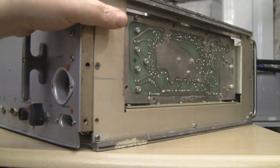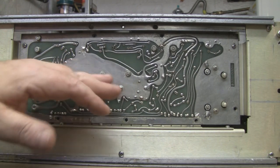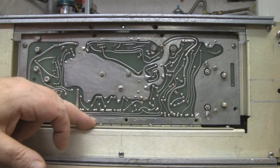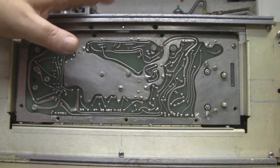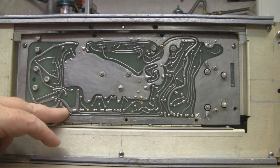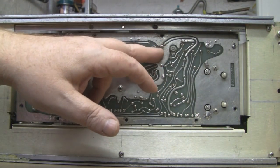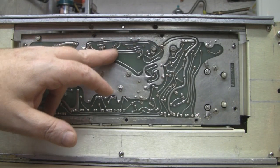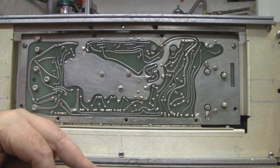Here's where all the high voltage stuff is. I can already tell there are screws missing from this panel — it looks like it's on a hinge and could fold down, but screws are missing from the hinge. The top part is also on a hinge for easy service access. There's definitely been some tampering. What I thought might be burning looks like flux residue, but somebody has clearly been in there soldering on these two points, and these nuts look like they've been off as well.